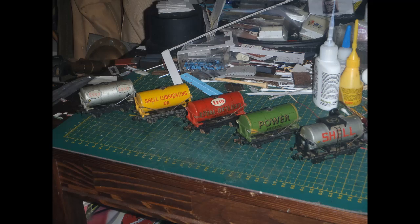At this point I put the wagons on the rails on the layout and promptly realized that I had another problem, as when I turned up the power the controller immediately overloaded. Hornby Dublo 3-rail wagons had wheels and axles that were completely non-insulated, connecting the left rail directly to the right. Clearly, some of these wagons were made for Dublo 3-rail and were simply shorting out the power on my layout. On checking, it proved that all of the wagons were indeed made for 3-rail except for the shell wagon that had the broken frame at right here.